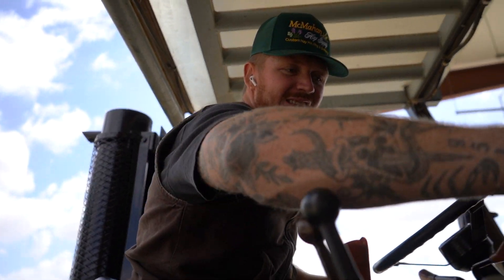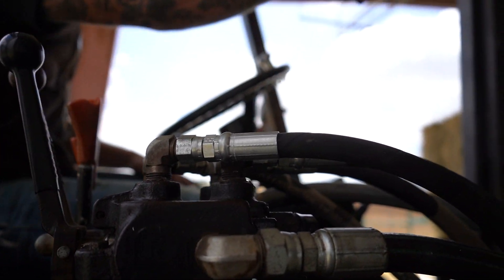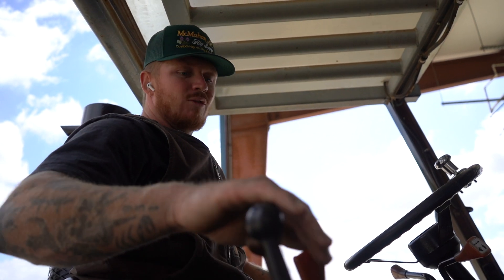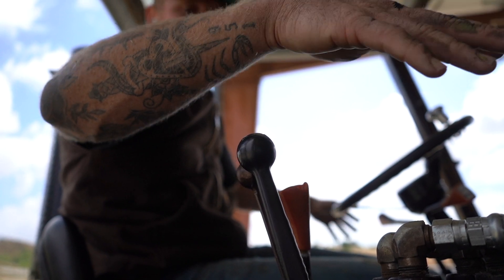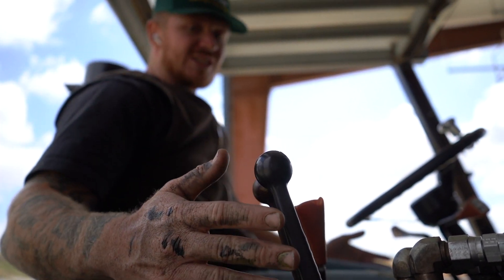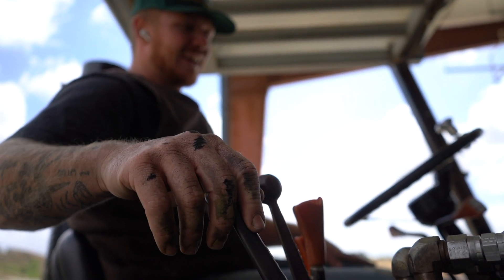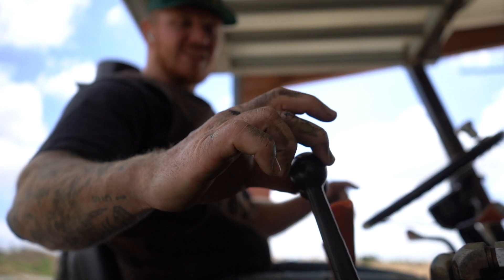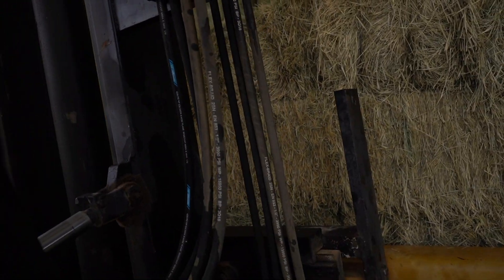I just recently replaced these two hydraulic lines. I thought I remembered which sides I put them on and which point in the cylinder, but I put them on backwards. Originally pushing both forward was opening both of them and pushing down was squeezing. But now pushing forward is closing it and going down is the opposite way — so now these go opposite directions of each other. I'm gonna have to fix that. It's not ergonomic.